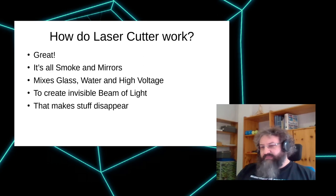But in reality, they're not as bad as they look or sound, because the whole laser stuff is all enclosed in this box, which is made of steel. And if you get a good laser cutter, which is class one, it's basically in the same class as a CD-ROM drive, which basically says there's a laser, but it's inside and can't get out. The thing we need to be careful about is if you do stuff you shouldn't or do repairs. Then be careful. Otherwise, it's actually a pretty nice machine. All the difficult and dangerous parts are on the inside. And if you don't do anything stupid, there's very little chance of you getting hurt. So I'm much more worried about other tools in our hackerspace, like circular saws or hammers or just normal electricity out of the outlet that people plug into some weird apparatuses.